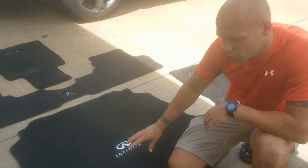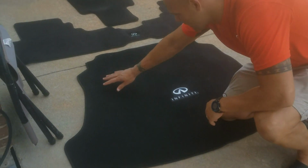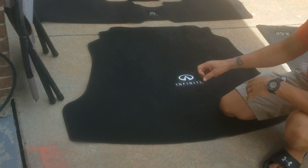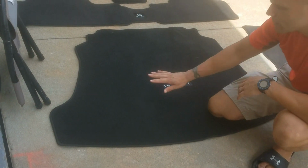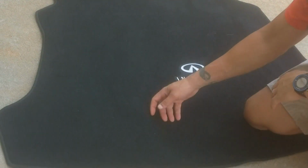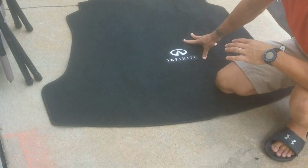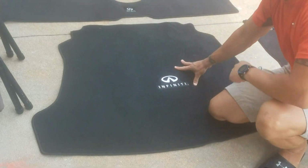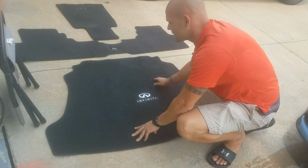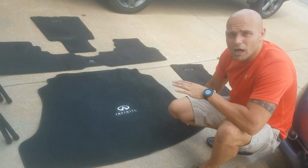When you're vacuuming and steaming the carpets, the first thing to do is vacuum everything. Once you vacuum everything, spray some kind of carpet cleaner onto the carpet. Take a brush and do straight lines, left, right, up, down, and then vacuum everything. Once that's complete, take the steamer and go left to right. You should see zebra stripe lines on the actual carpet.